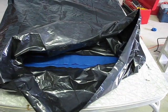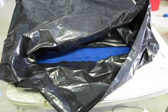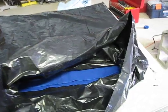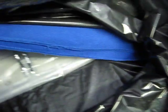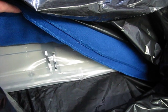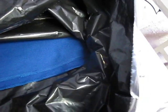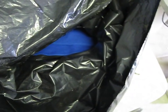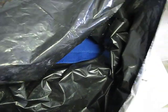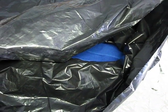I got my oven all built and I'm ready to do my vacuum laminating. I'll show you what I've got set up. This is my solar panel that I'm building — layers of EVA plastic — and then on top I put this blanket. I'm gonna run the vacuum tube in between here and then seal the hose around this bag. It's just a 50-gallon garbage bag, and that'll be that setup.